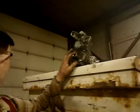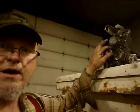Usually when those little plastic wheels wear out, those little gears, it's real simple. There's just one little gear, and then the other gear, the motor runs it. It's just on a little slotted shaft, and that's what pumps your fuel. It's a close tolerance in there, and it pulls a vacuum. But usually when they're junk, the pump loses its prime, and you've got to pull that plug out of the top of it.